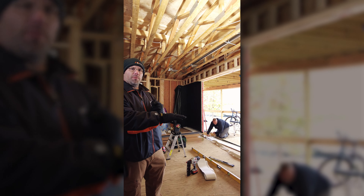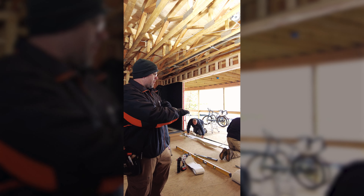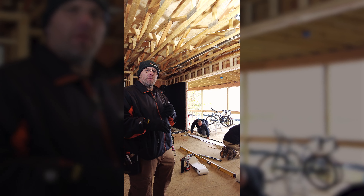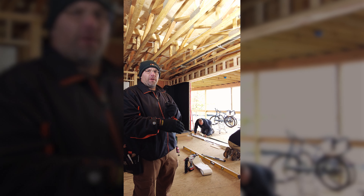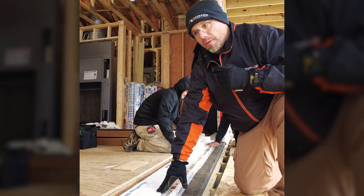Hi, here on site doing a multi-glide pocketing door with automation. We're first starting out checking the rough opening — what the builder did — making sure it's level, flat, and straight. We had to do a little shimming or layering of layers to get the sill level, and once that's done we'll do our final flashing and then we'll be ready to install.